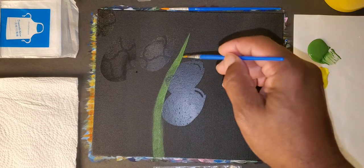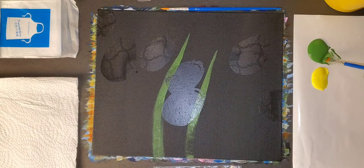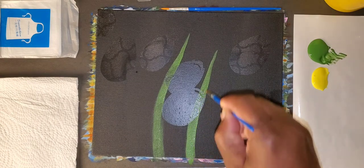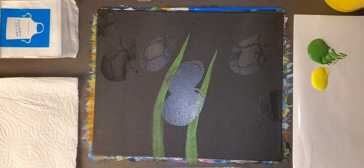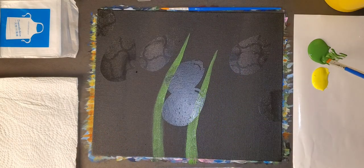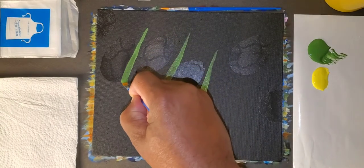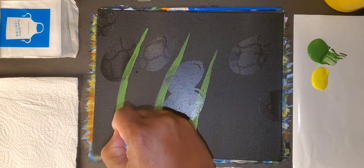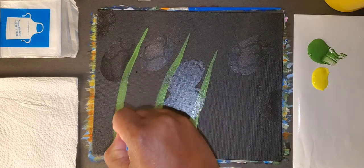Let's do another one over here — just turn the brush as you come along and let the brush get flat. Leave the streaks; you can always come back and clean it up. The thing I find most people do is stop midstream to fix it, when you should just follow through like a golf swing or a baseball swing. Follow through, then you know where the line is and you can go back, fatten it up, tighten it up. Watch: I lay the brush down at an angle, slide it, then slowly start to turn it. I let the paint dissipate, come back with more paint, and go right back into that line.